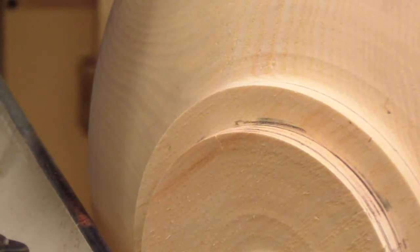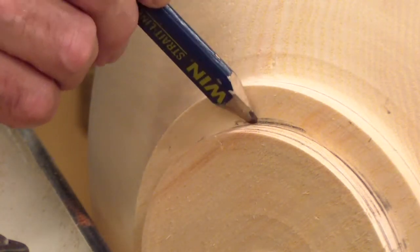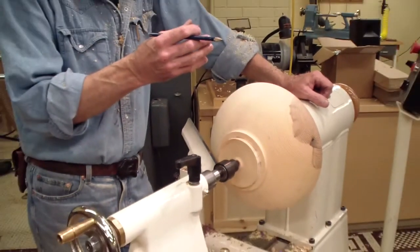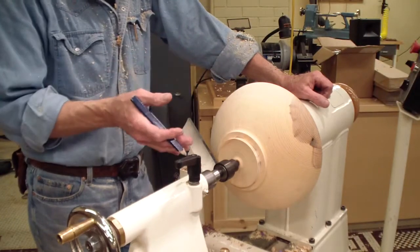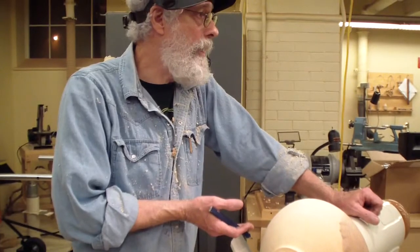So it starts with measuring the depth of the bowl and bringing it out here where I can see it. Then I add a wall thickness, and then I add something for a foot. And then I go backwards and cut away until I have what I want, and then in terms of location, it gives me the freedom of shaping the foot and locating the foot wherever I'd like it to be, all determined by the depth of the interior.